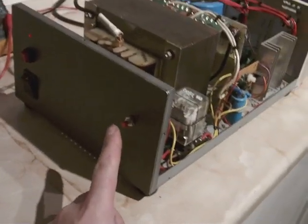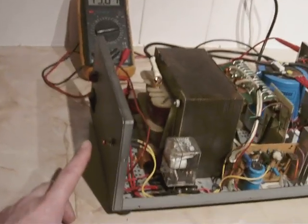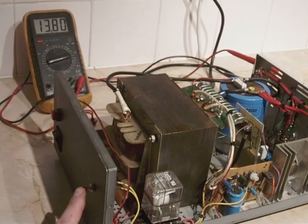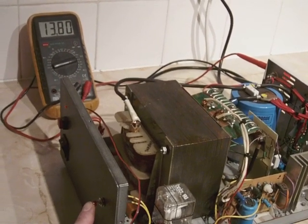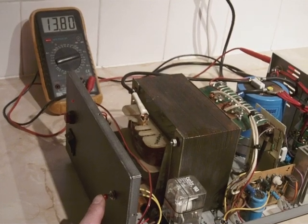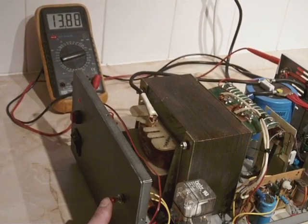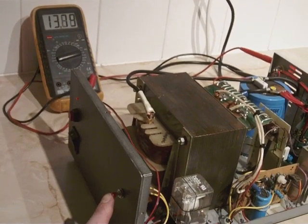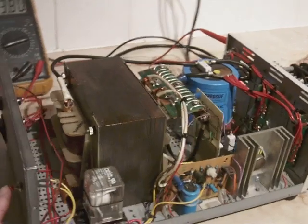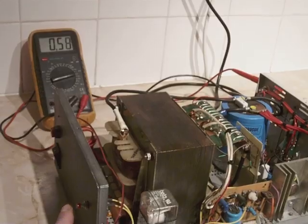This is the test button for the over voltage circuitry. This puts the voltage up to about 14 and a half volts, which I've set it at — quite a nice voltage to turn everything off. It stops. It's not high enough to cause any damage to a radio, but it's high enough to trip the over voltage circuitry. If I press it, it should knock itself off.